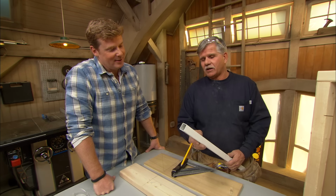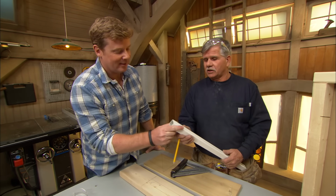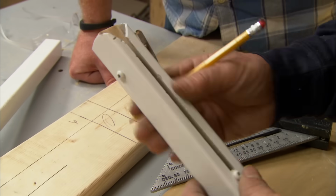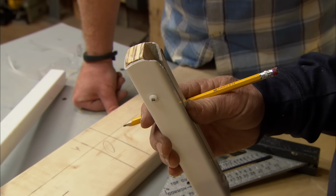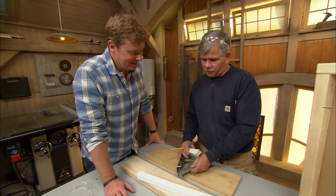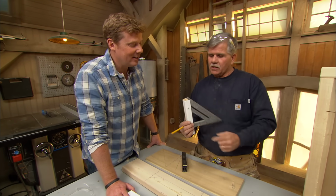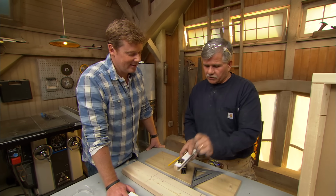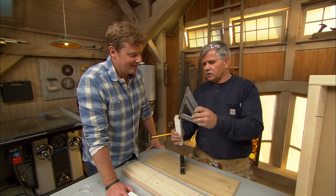This is a square baluster. It's a PVC piece of baluster that you get at the home center. So I've taken that baluster and I cut it to length. I put a piece of 3/4 inch plywood in there to stiffen it up. Put a little slot in it with a screw on the bottom to stop it when you drop it in place. Reinforce it on this side with a screw and screw the belt clip on the other side, and you have yourself a speed square holder.